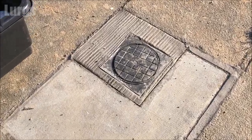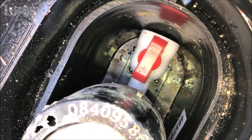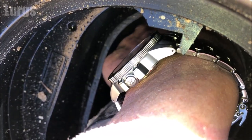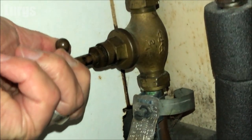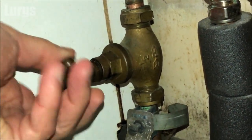What you need to do first is turn off your mains cold water. This could be out in the street — if it is, go and find it and turn it to the off position. Don't do this if you live in a block of flats because you'll isolate everybody's water. If you can't find it in the street and you've got it indoors, locate your stopcock and turn that clockwise all the way off.